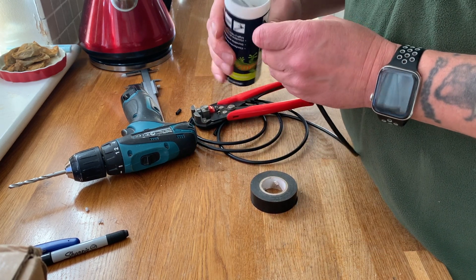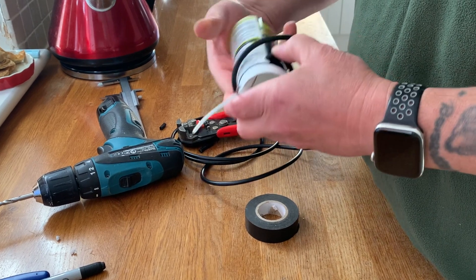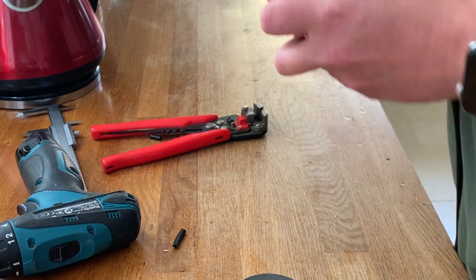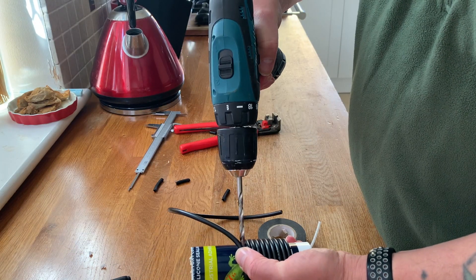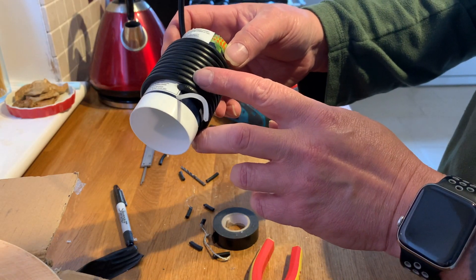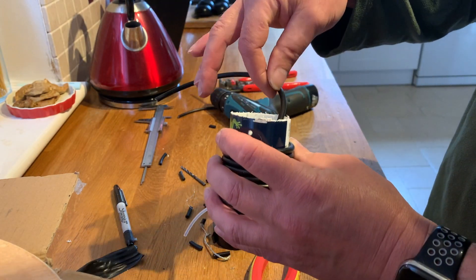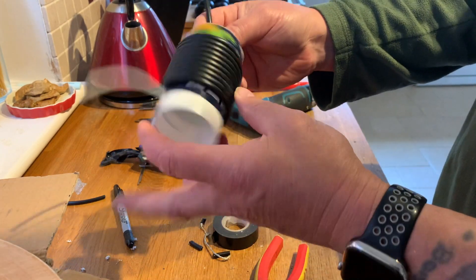Let's try to do our turns. Like I said it's nine turns around this former - nine and a bit. We need to make our new hole; this is really thin plastic so it's not difficult to do. One, two, three, four, five, six, seven, eight, nine and a point two or something to there. What I'll do is peel that back now and strip the coax back to about here. Actually I'll cut it now and then we'll do some connections.